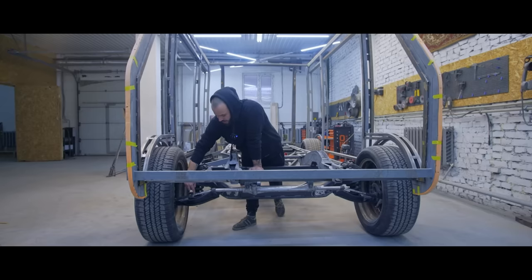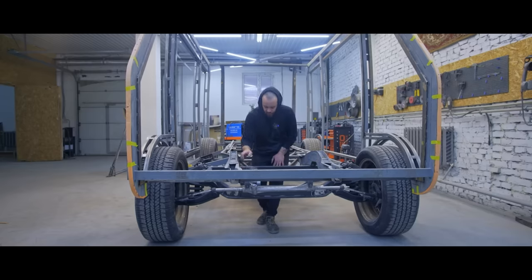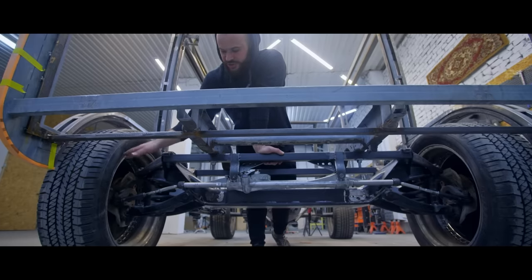I'm glad that the screw threads on the Toyota RAV and Isuzu steering rods are the same. That's why we didn't have to weld, we just ordered these sleeves. We combined two joints, from RAV4 and from Clio 3. They are already connected to the steering power assist. Here you can see clearly why we used these extension rods. To move the ball from here to the axis of the levers, so that when levers work, the alignment remains the same.